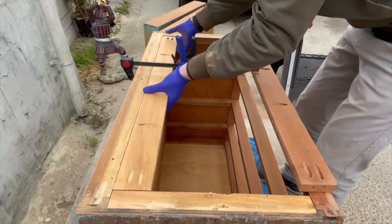When the bottom was waxed, I drilled some pilot holes and I attached the mounting plates and the legs to the bottom of the dresser. When you're removing paint with the method that I showed you a minute ago, it will leave some marks because you're going against the grain. So with some hand sanding, you can easily get rid of those marks.